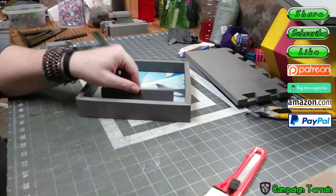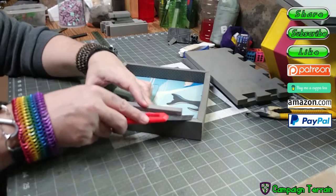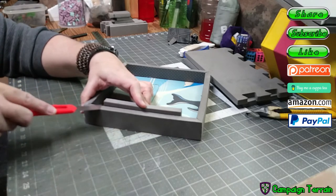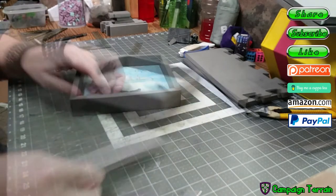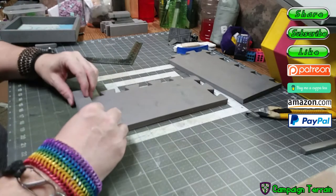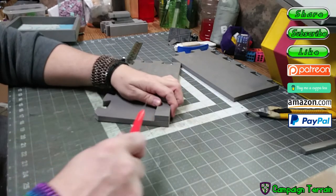Now with the bottom in place, I'm going to take another small strip, measure it against the inside edge, and use a knife to mark off how high that's going to be. I'm not going to cut it there because that would give a crooked line — I'm just going to mark a couple of points and then use a straight edge to cut it off, so I have a gauge for how wide to make the inner pieces. I'll use that gauge to mark both ends of the strip, then use the straight edge to complete the cut.